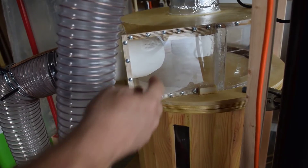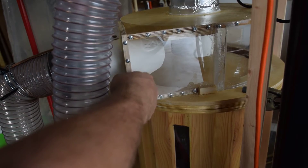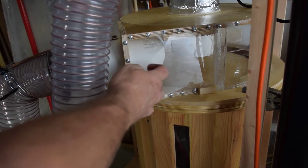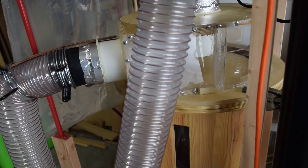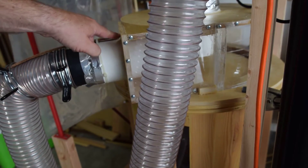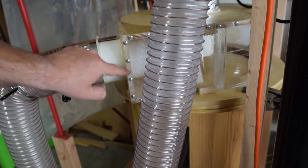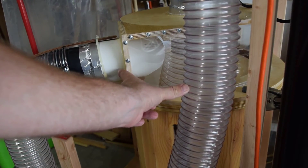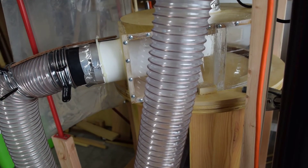You see this little nook right here where the hose goes in? This actually causes a little turbulence and dust builds up right around here. If you suck too fast, dust will definitely build up right here. However, the suction is so great that, as you can see, it cleaned it out. What I may or may not do is put a 6-inch PVC, get closer to this edge — because you can see the 4-inch PVC is a little further back — put on a reducer, and use just a 4-inch hose to see if I can maximize vacuum strength.